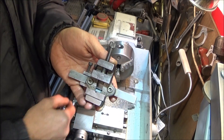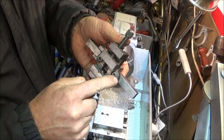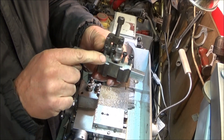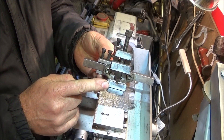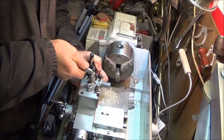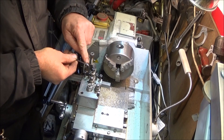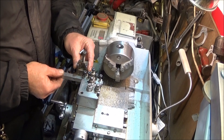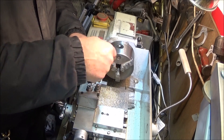What I use for doing this sawing on the mini lathe is this small vice here. It has a V in there for putting bar in, and I've bolted it nice and squarely to a piece of half-inch square mild steel. It's then fitted into the quick change tool post holder. I use this both on my Myford lathe and the mini lathe for various jobs — it's a very handy setup. You can undo the locking bolts on the quick change tool post and, if you're at maximum travel of the cross slide, slide it to whatever position you want to give yourself room between the job and whatever tool you've got in the chuck.